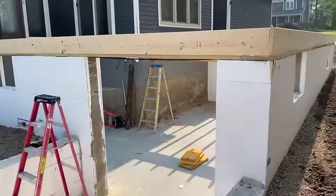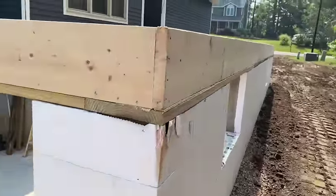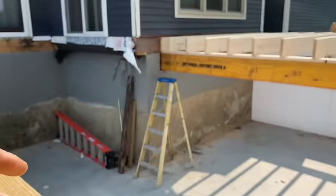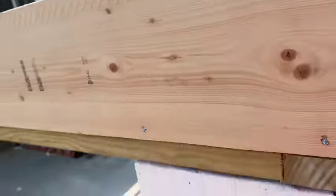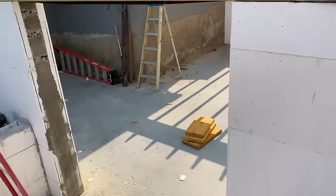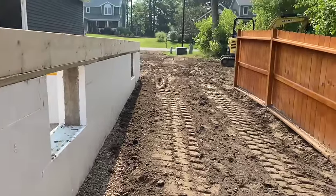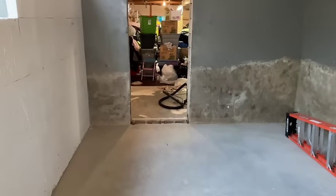They started framing it. Cut a beam pocket over there. Got his beam in and everything. Turned out pretty good. We got a drain here that's taped, but we'll come back, sweep everything up, and parge it. That's what she looks like. Thanks for watching, guys.